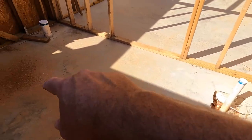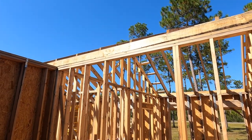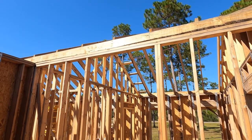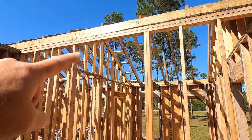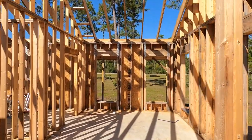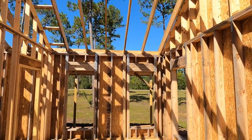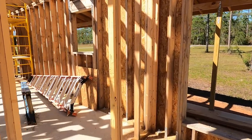Four foot by four foot toilet room and vanity room. What we have to do first is get the plywood up — that's happening this weekend. We're going to plywood the roof and then frame in the roof on the top of this section so we have something to set our ridge on. That's why the bathroom is not framed in yet. You can see in the bedroom it is all cathedraled also. We did that because the house is kind of small and we wanted to make sure it made it feel really big.